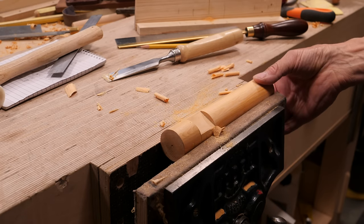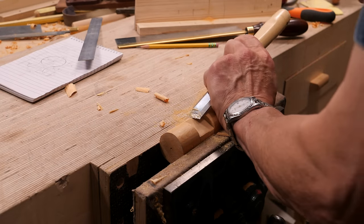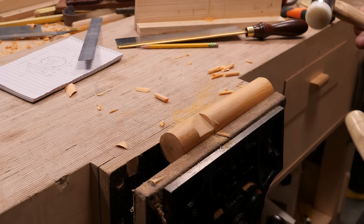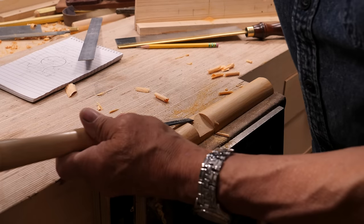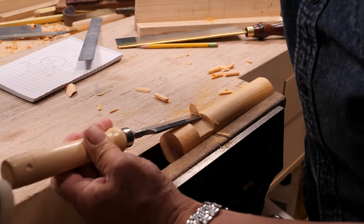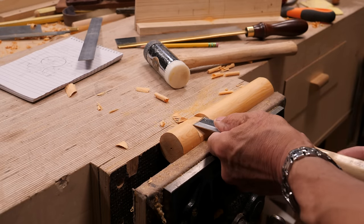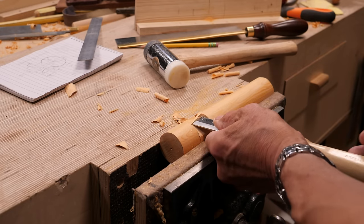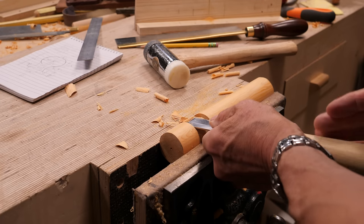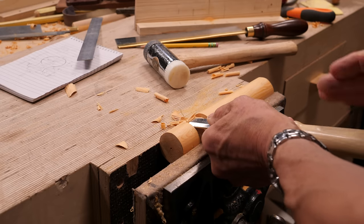Now let's take a look. If I rotate it this way, just slightly, and do the same again, take off the highs, like that. Just take out a little bit of the opposition. Like that, and then take out the midsection with pare cuts. Now see the grain is changing a little bit there, but I feel good about it. I'm going to keep going. As long as it's in my favour, I'll keep going.